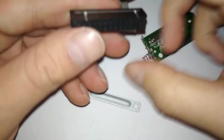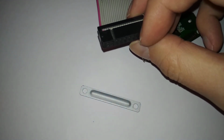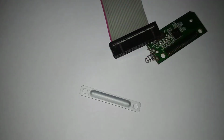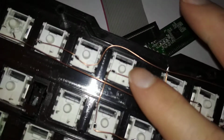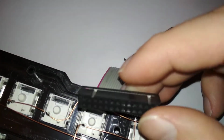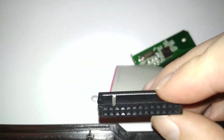And then I'm using these UTP cables without the insulation for the keyboard. Like these. So these will go directly into the holes of this plug. I don't need to solder anything. They will just go in and make fine contact. And that's a time saver.